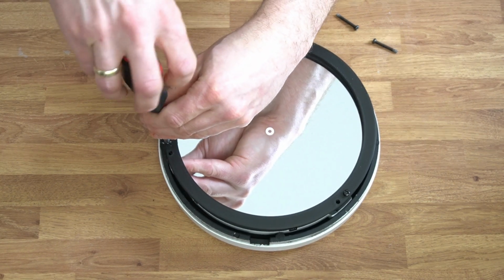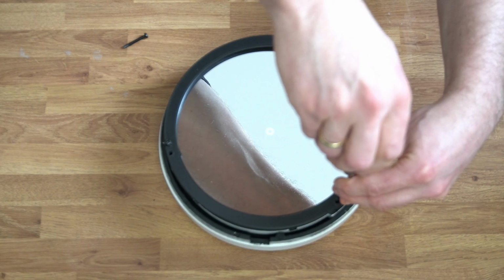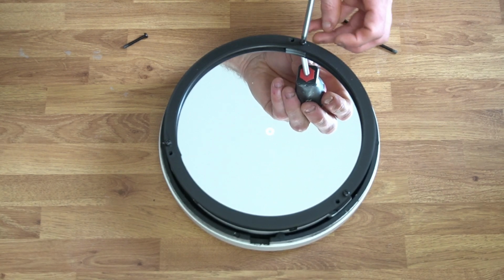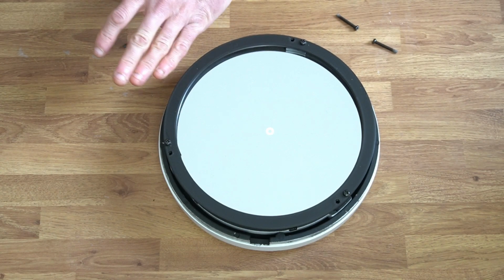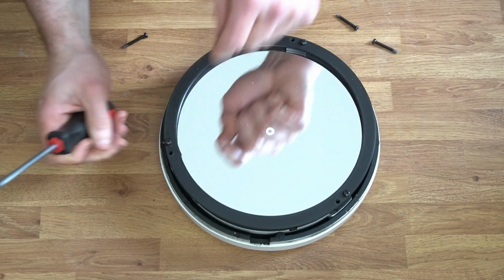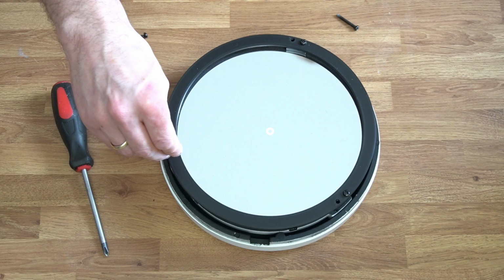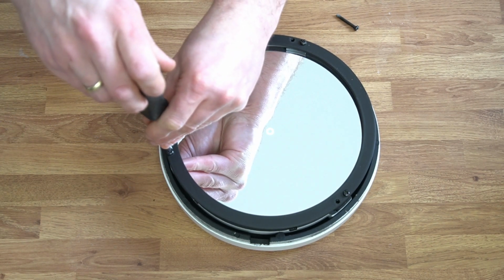You then use your screwdriver, 2 hands, okay, just tighten up a couple of threads either side, and either side this side. Now you notice the baffle is not touching the primary mirror. So you've got a baffle there. Now you're going to have to line up the holes, right? So once you've got them with a couple of threads, you then grab the second screw and just wiggle it until you line up the hole, and then tighten that up.